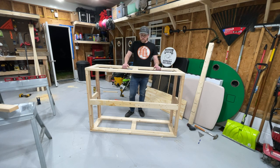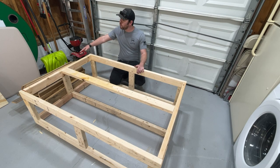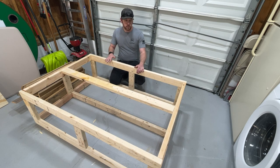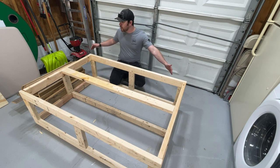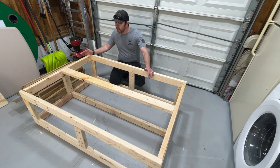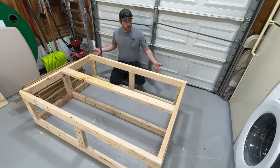It's a new day. The next thing I want to do is lay out all my pallet boards to check fitment before screwing them down. This frame is 60 inches wide and my pallet boards range from five-and-a-quarter to five-and-three-quarters inches wide, so I'm not going to get a perfect lineup. I need to figure out how to lay them out and how to handle the ends to wrap around the corners. Let's lay it out and see what it looks like.